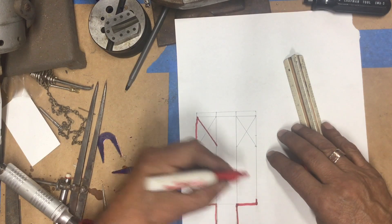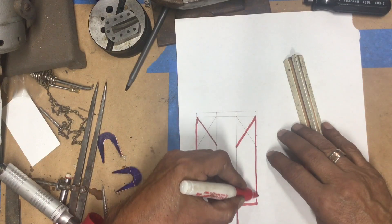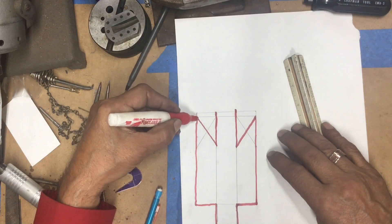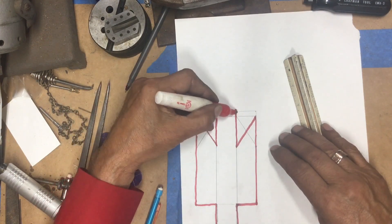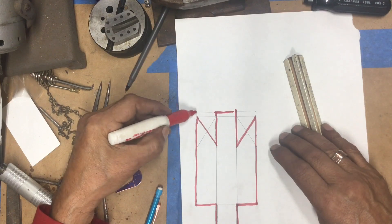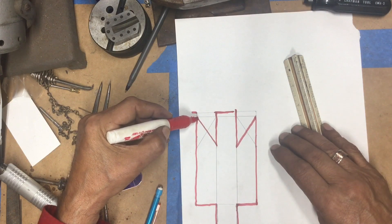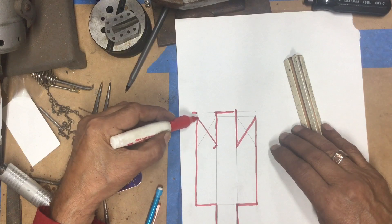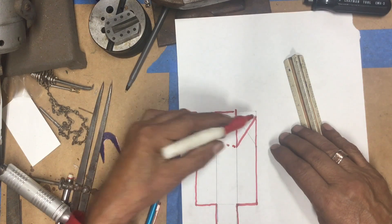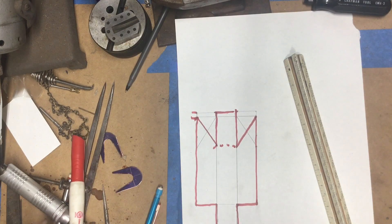This is the body. What happens is this will get cut out and bent. The extra quarter inch here goes to this bottom plate, and is equal to the distance between here and here, so that when this is bent up it'll match that point there to that point there. And this will get traced onto the copper.